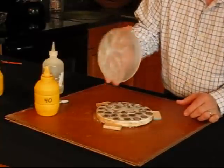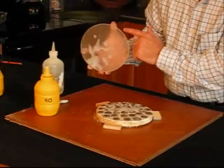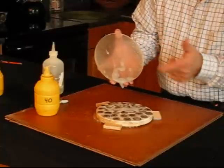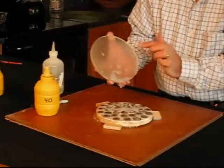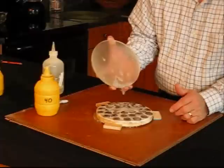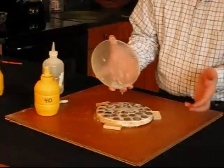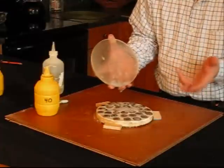After only a few minutes, you can see my magic marker is just about all gone — nice and even — which means I've got a good sphere and good contact. If you only saw part of the magic marker gone, that means your part wouldn't be very spherical. It might pay to go back and clean it up better, making it more spherical with coarser grit before moving to finer grits.